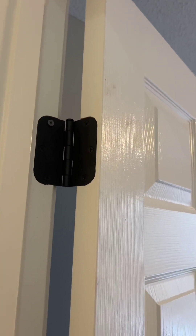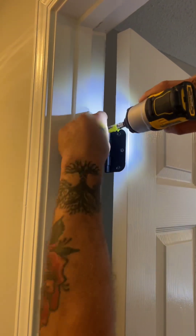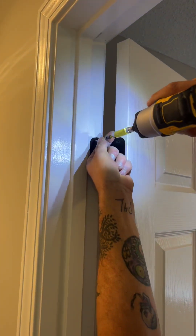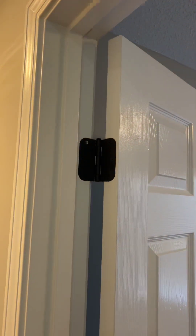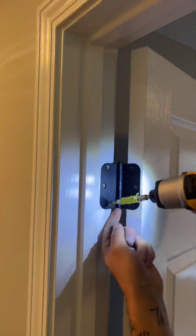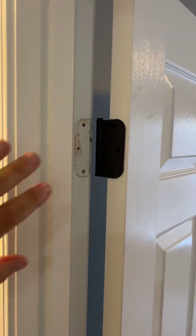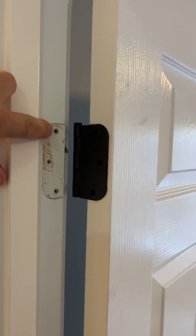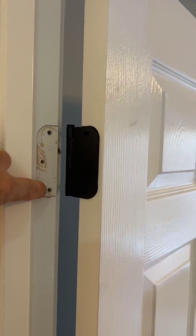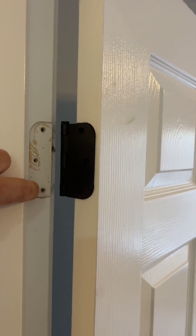So Jonathan here is going to attempt to do this. You can see that three-inch screw is completely stripped out. He's got this hinge open and he's got these three holes. We know this one is completely stripped, but we might as well put three anchors in here. He's going to drill the holes out so that they're bigger so we can put the wall anchor in there.